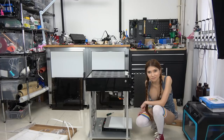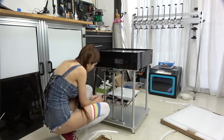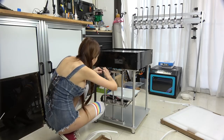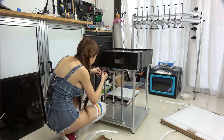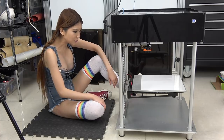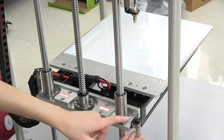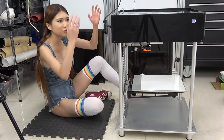I have to call on my elf — be right back. So the printer is assembled. It is heavy and it is rigid because they are using the 10mm thick machine aluminum plate. On this end there is a micrometer for adjusting the Z-axis and on the other end is the induction sensor. Now let's look at the top.